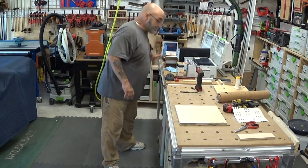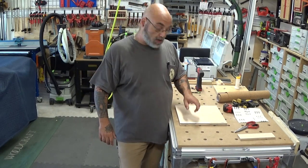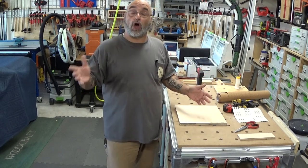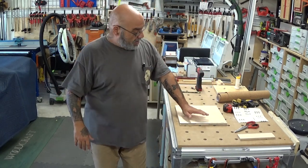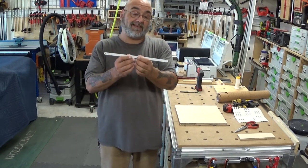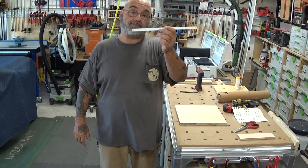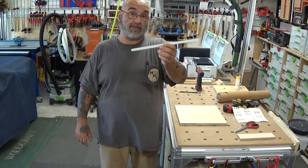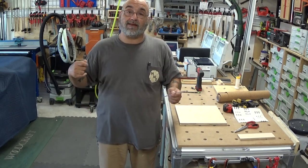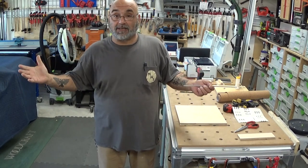What I have here is a piece of 3/4 inch sandable plywood cut to 12 1/4 by 12, because the sandpaper is 9 by 11. Your hacksaw blade, which you're going to use to cut it, and I guess you already pretty much know how I'm getting at, is just about 12 1/4 inches. And we're basically going to use the hacksaw blade like when you're ripping saran wrap out of the roll. That's basically what you're going to do.